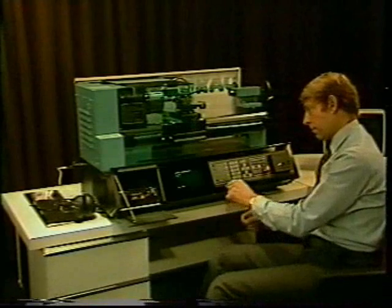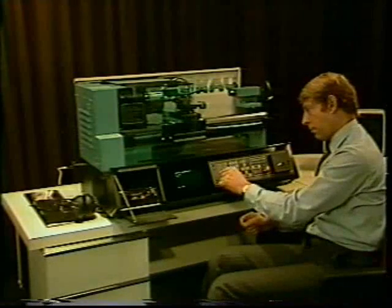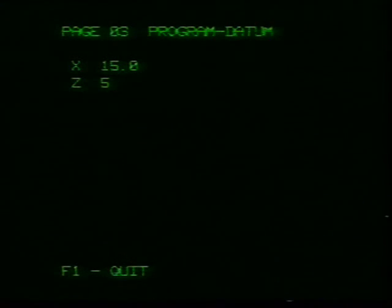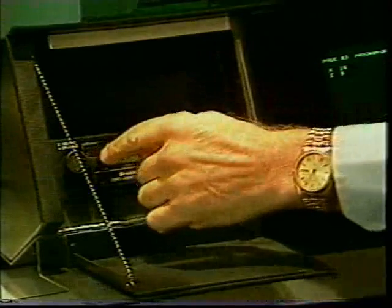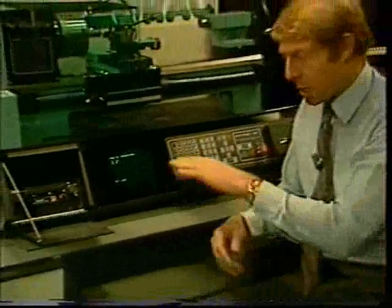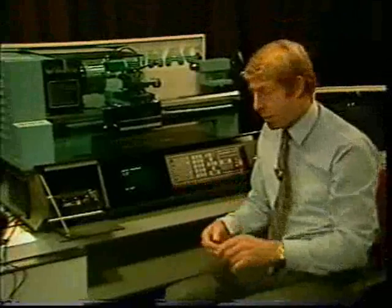Now key in the Z value taken from the end of the workpiece as 5 millimeters — 5 millimeters, and again enter. Enter this information into memory by pressing E. Let's leave it there, and as I said, you can see how slowly and sympathetically the information comes at the trainee, so all the time he is, as it were, in control of the situation.